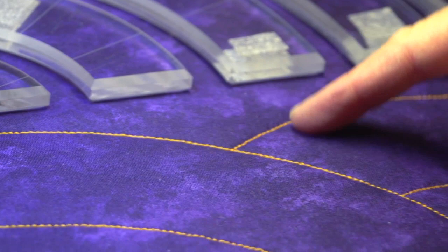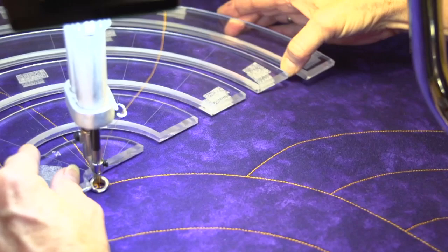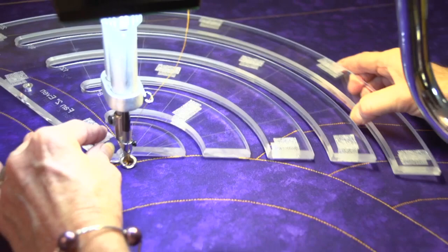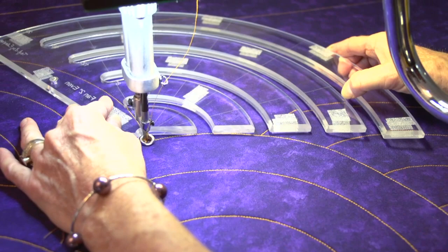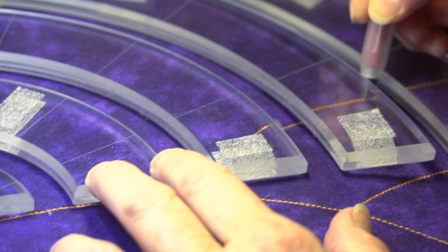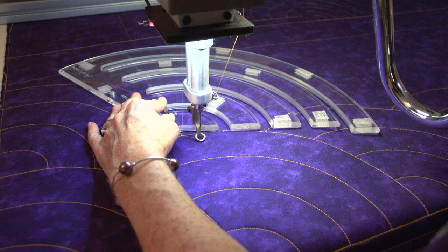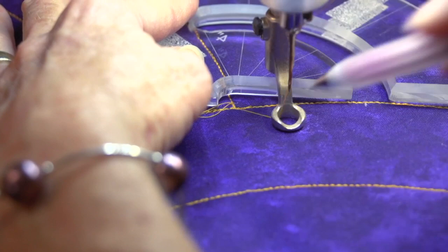Notice I don't have enough ruler to touch the back of these — that's okay. This is what we talked about earlier: it's a circle so there's no top and bottom. You can rotate this on this foot all day and get the same shape, the same circles. I need to get to my starting place and find it. I rotate this around, grab my marker — whatever type you prefer — and just mark these approximate places where I'm going to hit that back. It also works to mark the pivot point where it taps this seam, just as a reference point in case you pick that ruler up.